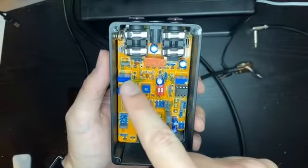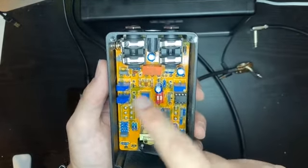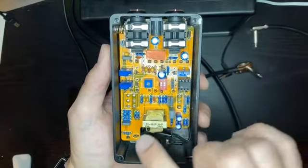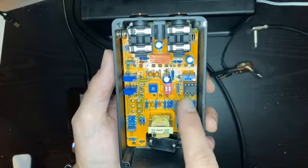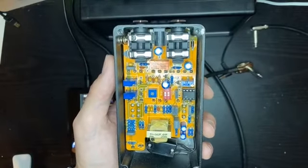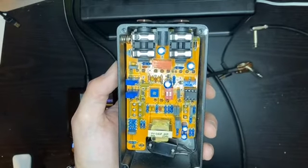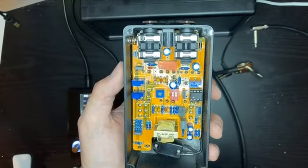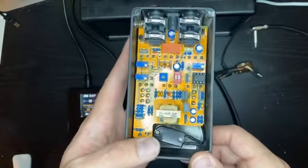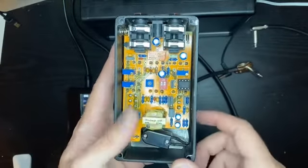So you have a couple of preamp JFETs, which are like the preamp tubes, and this is all pretty much the same as what's in the actual Plexi. It's really when you get into this section where the magic happens. So I just use a standard TL072, which is just a standard op amp. That's what's in the Klon, and most drive pedals these days. It's in the Angry Charlie, it's in the Marshall Governor. Basically anything that's not Boss is going to use these Texas Instruments chips.